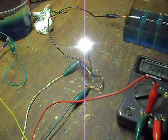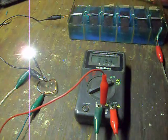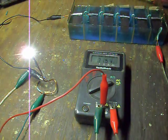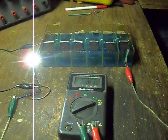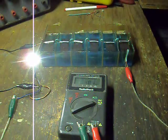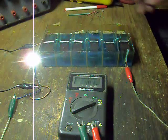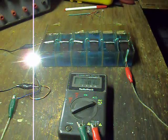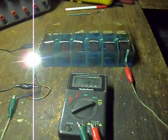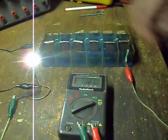Even at 15 hours into operation, using a slow method with just straight water, you can already run a radio to full capability. Approximately 24 hours after commissioning, the current output is about 40 milliamps and seems to be leveling off. Based on the size of the zinc electrodes, I estimate probably another five to ten hours before the electrodes start reaching a state of full consumption.